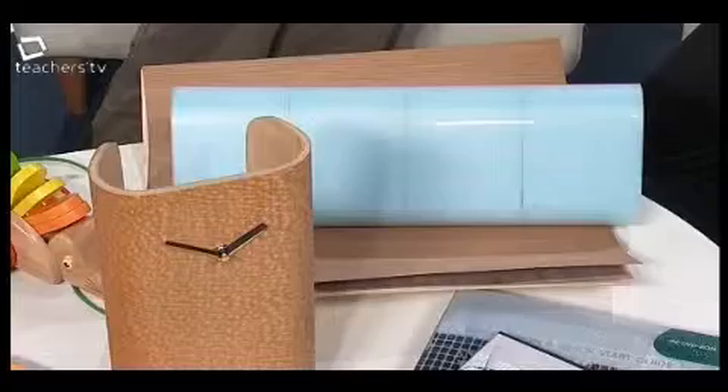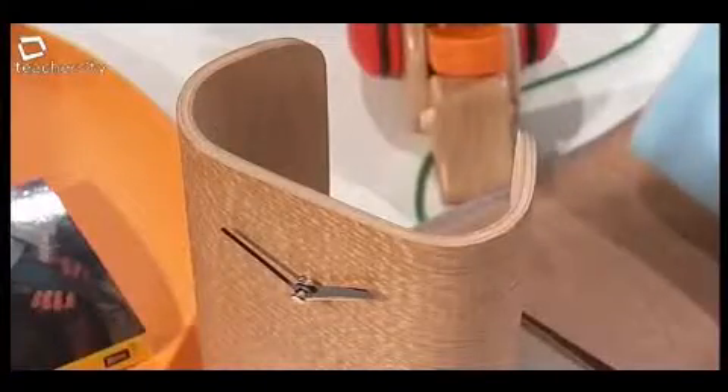Your first resource is called the Bag Press. You've got some components of the kit here — can you explain this resource to us? It's actually a manufacturing resource. These are some of the pieces of equipment that you use with it, and this is a product that's been made using it. Basically it's a vacuum that you link to a bag, and then you can veneer wood around a mould inside the bag. The air is then sucked out of the bag, helping the veneer to stick in curvaceous shapes, giving you the opportunity to make quite organic, fluid, curvy shaped products.